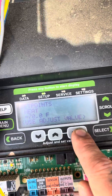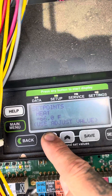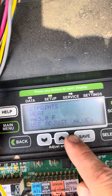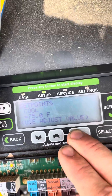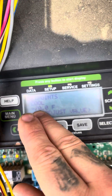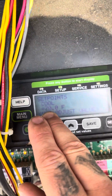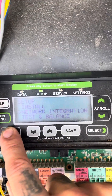Backup mode set to Return Air Sensor. For the heating setpoint, we're in Florida so I don't really care much for that — it'll probably never come on. For cooling, we're going to have probably a three to five degree split. So the occupied temperature, about 73 degrees — let's go with 70.